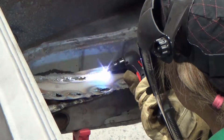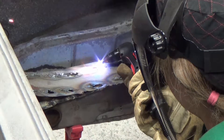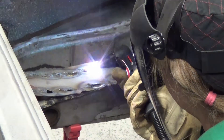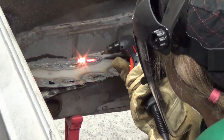The thinner your sheet metal, the lighter the touch with the plasma torch. Try holding the torch at a flatter angle and bouncing the arc off the metal. Each situation will be different depending on the thickness of the metal. Older, worn, rusted metal will quickly melt, so watch closely and move the torch quickly.